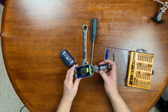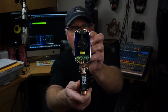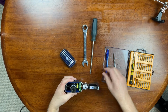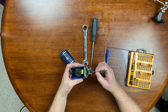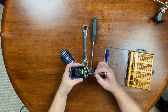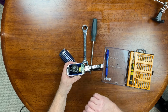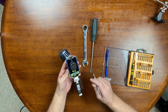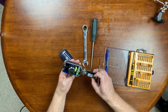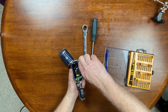Got the capsule in here, and there's 4 screws that need to come out. And we show it that side there. So I'll take those 4 screws out, and if you can see from the other angle camera here, there's a yellow wire right here and then a black wire. So yellow wire to this lead and a black to this lead, and those are the 2 that run down through the spring in the back. So pretty sure what I'm going to do with this is put heavier gauge wire in it, I think. I'll see. But anyway, we'll take this off. Take this out, I should say.